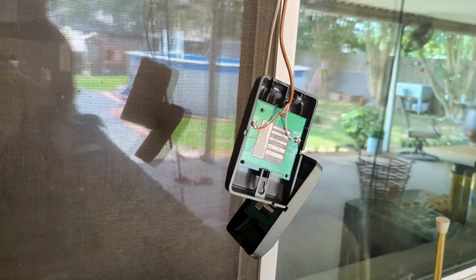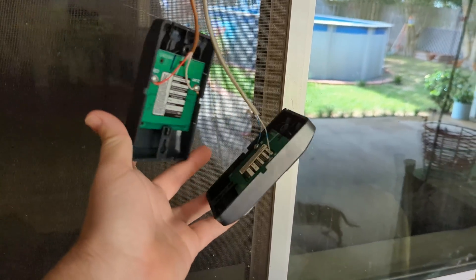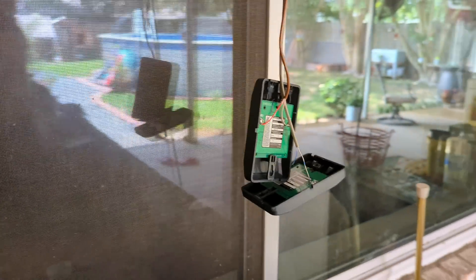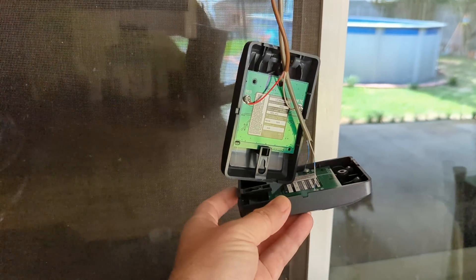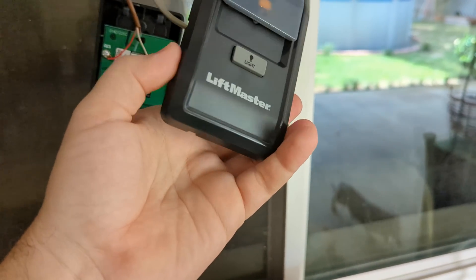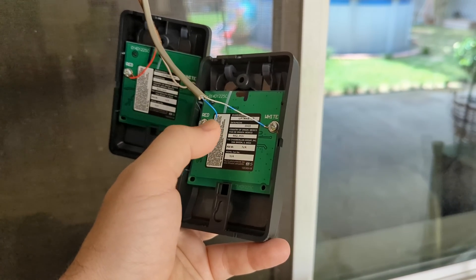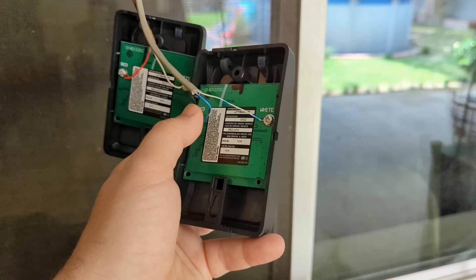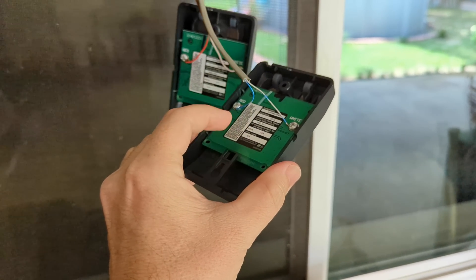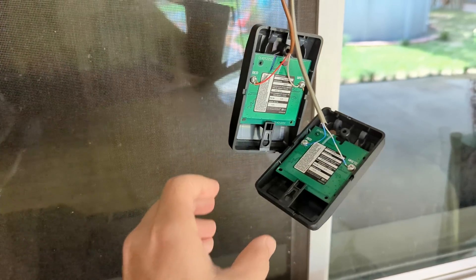You can see for now we just have two buttons hanging here. I'll mount these in the washroom — they wouldn't run inside just due to code reasons, which is understandable. One thing to note is we won't be able to do the project where we just have a Shelly close the dry contact on these two wires, because these are digital buttons. We'll do that differently with a spare garage door opener, which we'll get to in the project.